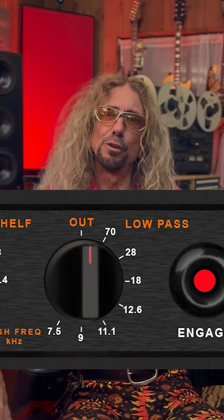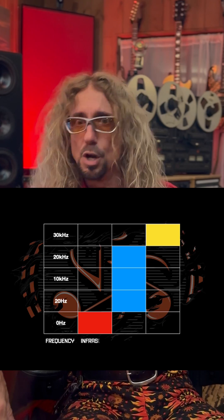Greetings, audio conquistadores! The high-cut or low-pass filter reduces ultrasonic noise, which is an A-to-D converter's audio nemesis. This high-frequency chatter comes from a myriad of man-made and natural sources, which propagates slew-rate overload, ultimately manifesting itself as harsh, brittle sound.